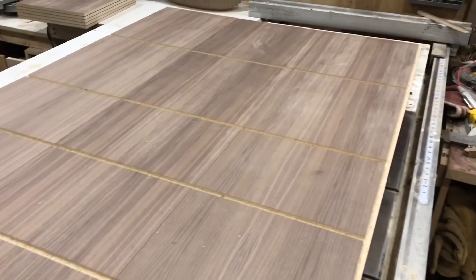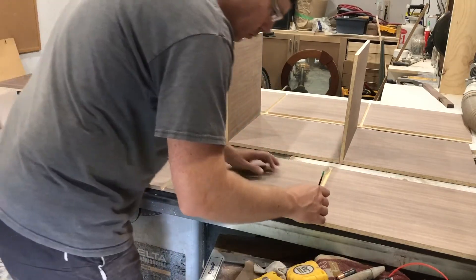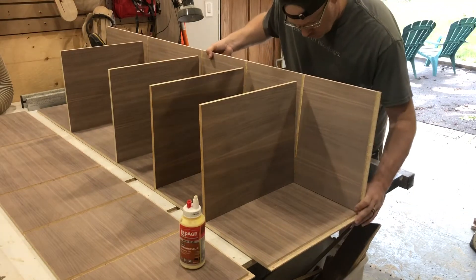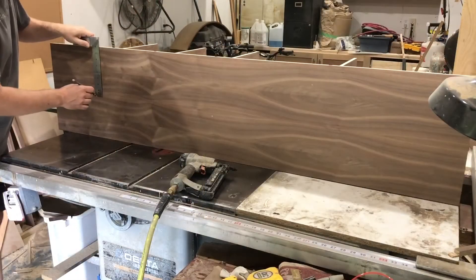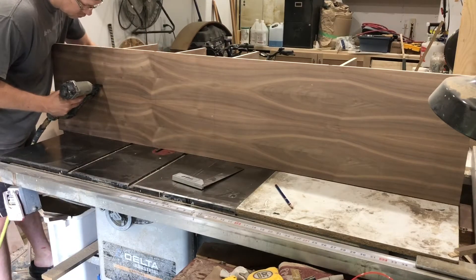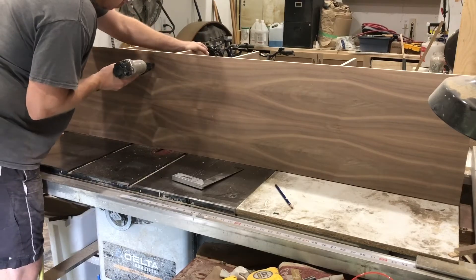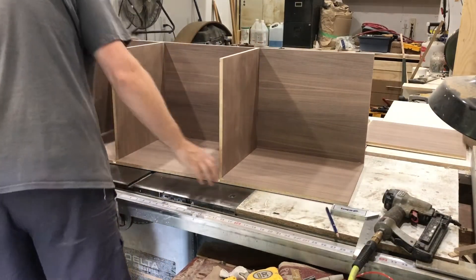Here are all three panels finished, laid out and ready for assembly. You can see the assembly here — I didn't show cutting the shelves since that's redundant from what you've seen. Because I used the dados and grooves, projects like this go together like Lego blocks — really straightforward and simple — and you're going to get a really square finish. I'm using a small hand square to mark lines so I know where to put my nails, so the nail is dead center into each of those shelves.